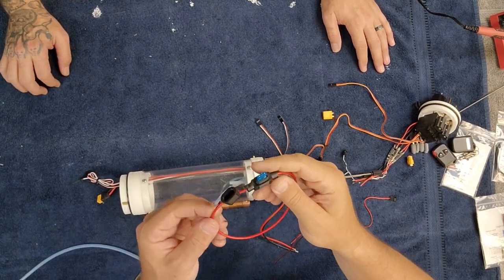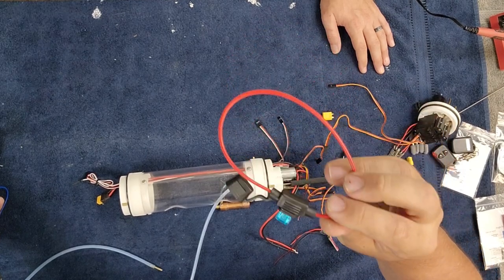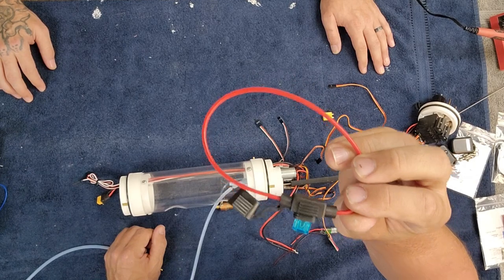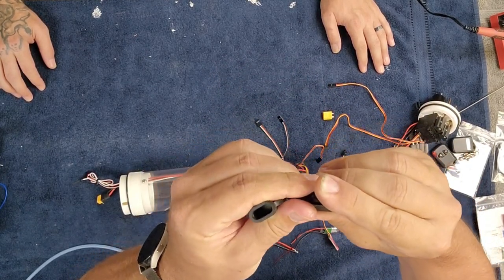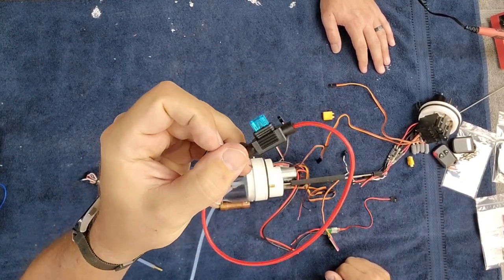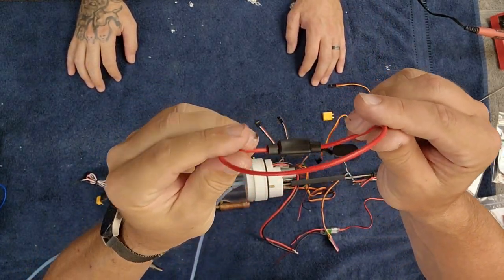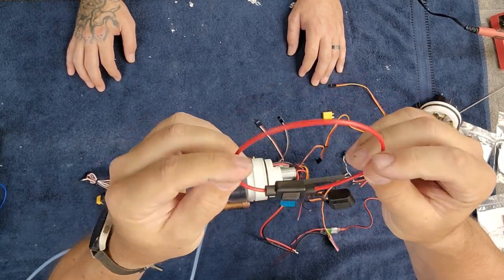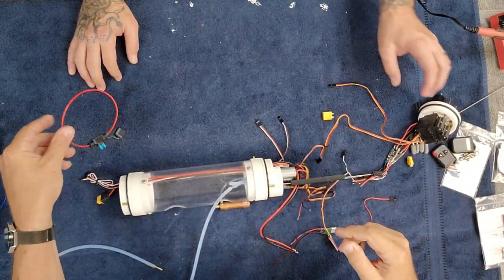All right, one point that Jason just brought up, there was a fuse. If you're not using the remote on-off switch, you need to install this between the battery and the rest of your cylinder. This is what's going to blow in case of excessive current in your system. If you have a short circuit, it'll protect all of the components of your boat. So this is just wired in series with the positive cable coming from your battery, all right? So not in your battery, but after your battery when it connects to the rest of the cylinder.